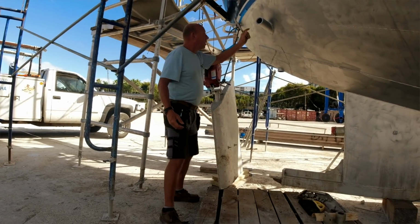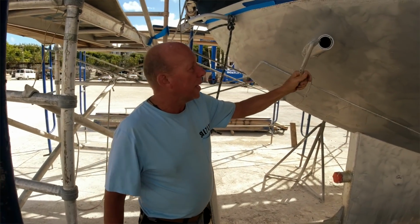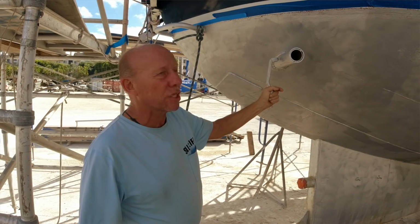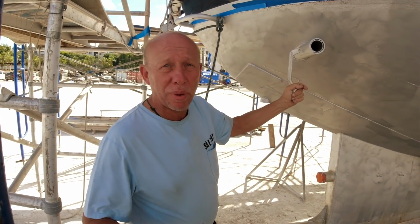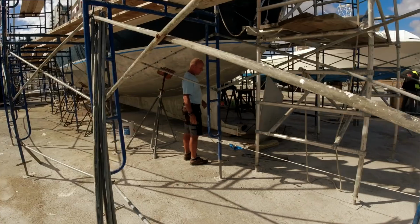You'll see here is the exit tube. It's a 2-inch exit tube, double wall stainless steel. It'll be cut off at the right distance. So this is for the starboard jet thruster that we've added so that the system has a bow thruster of hydraulic and it has a water jet thruster for the stern.